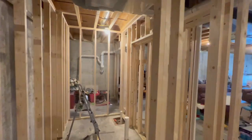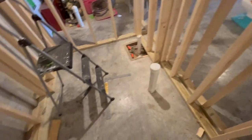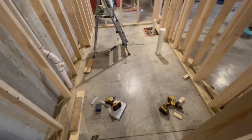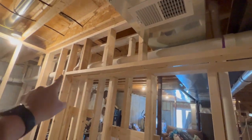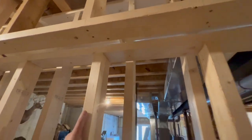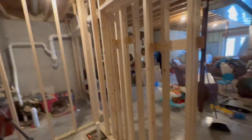Bathroom is completely framed. The last wall is in — you can tell it kind of looks like it's recessed because we had to box out that pipe right there. Obviously I had to build my wall up underneath of it, because of where we located this. We rough plumbed this estimating how we wanted the bathroom, and I wanted to put this sewer pipe inside this wall, but it made it a little challenging. It's going to look good though — this will look like it's boxed out in here, and we've boxed out the tub as well, so that should tie right in.